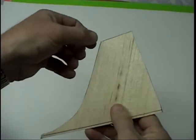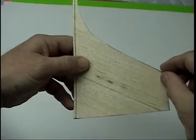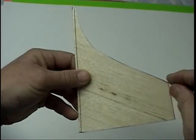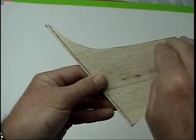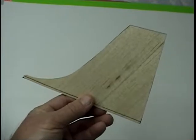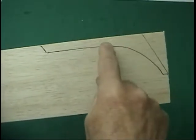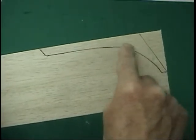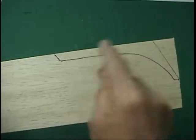Okay, now the next step on this is I need to make up a leading edge piece going back maybe, I'll go even a little further than I have to, because I want to really put a taper in this. I want to make a leading edge piece with the grain going exactly parallel to the leading edge. And the key thing is I want the grain in this dimension, basically because in here where this is going to get tapered, I don't want to see the grain going this way. I want to see it going this way, and it's going to add some strength.